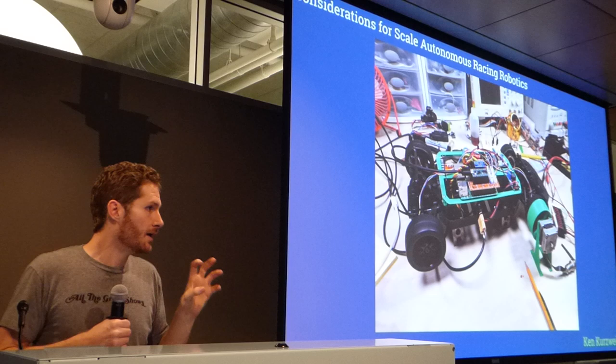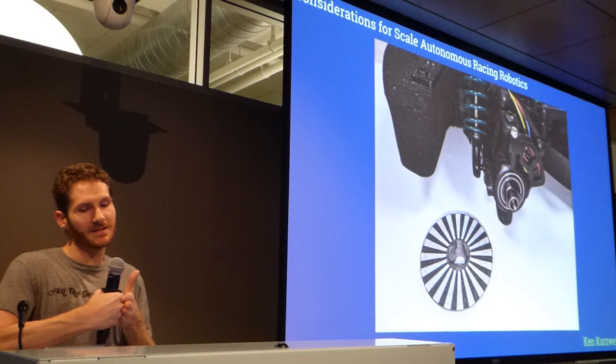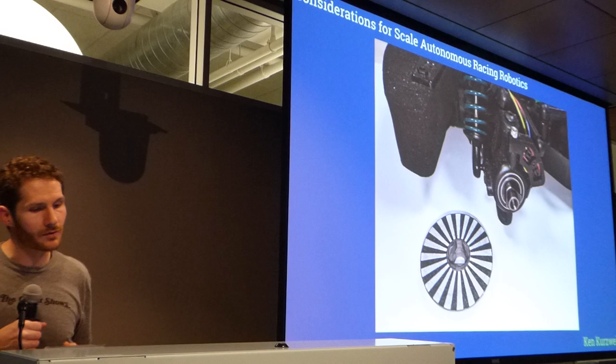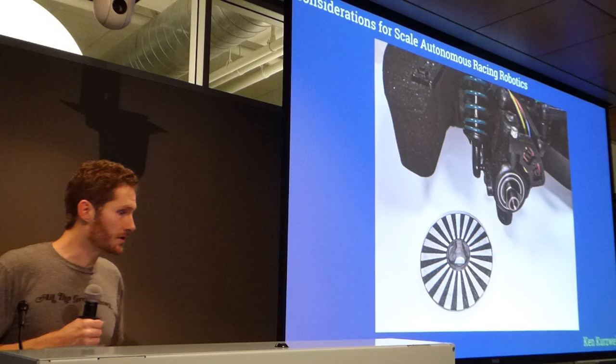The hub that I can place over this car to revalidate that my software is working correctly and that the encoders work the way I expect. One thing I found is that the distance between the actual photodiodes and the encoder wheel itself is very important. To get a perfect sine wave, I found that taking a little pencil lead on your finger and darkening the encoder wheel is a way to fine-tune its performance.